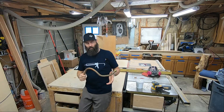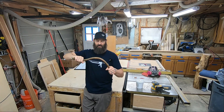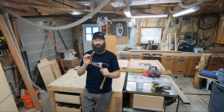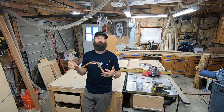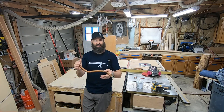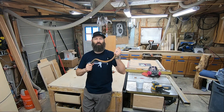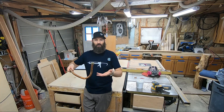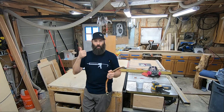I wanted to jump in here quickly to explain these flexible hoses. Why are they here? Why am I using them even though this is solid copper? In a lot of areas of the world that have basements, the ground moves up and down. You have to have a flexible connection for anything that is sitting on the basement floor and attached to the rest of the house, because the house doesn't go up and down but the slab-on-grade basement floor does. Anything with a gas hookup — like a gas dryer, a boiler, or a furnace — has to have a flexible gas line. All water heaters have to have some sort of flexible connection, so when that basement floor goes up and the water heater goes up but the house doesn't, you don't have burst pipes. That's why in my videos you will never see a union connecting a gas line or a water line to an appliance resting on a basement floor.